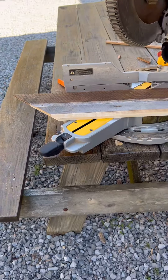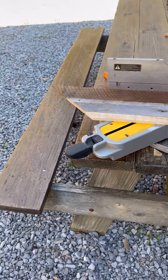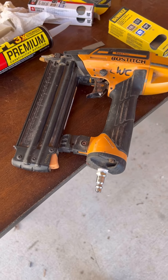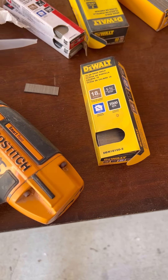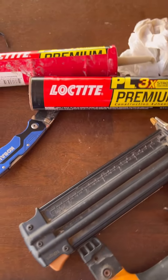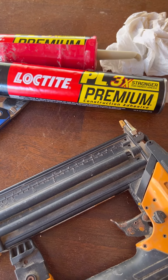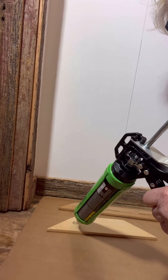When you're doing a bunch of cuts you want to make sure you don't get out of whack with a run, because then you'll have a lot of bad cuts. This is what I use to attach those boards on the wall — I use my brad nailer with inch-and-a-half inch nails and a little bit of adhesive. I use Loctite premium, but you could use whatever. Apply the adhesive down the backside right here.